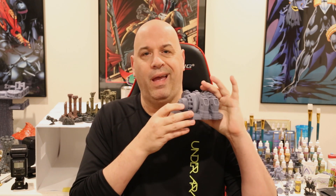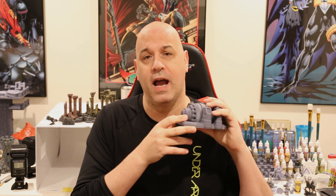Some of my theories on how to print better are a little contrarian to what other YouTubers or articles say — and here comes another one. The general consensus I found was: never go above 20% infill on terrain, because higher infill fills the model, making it heavy, using more material and more time. The wisdom was that strength comes from perimeter walls, not infill — and I agree with that part.